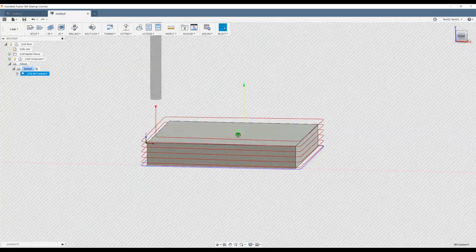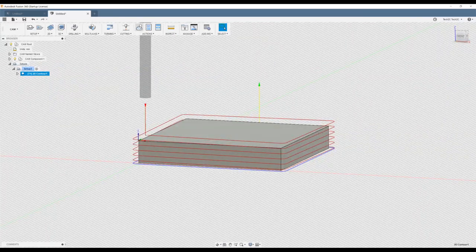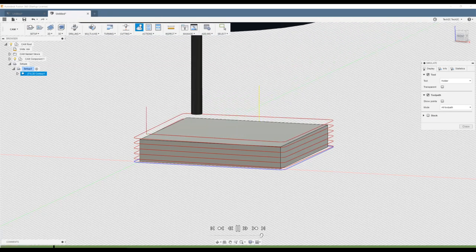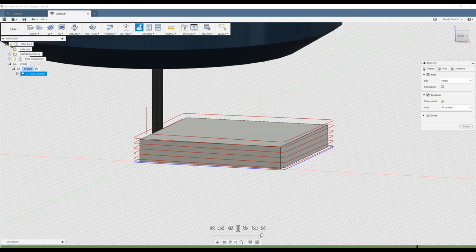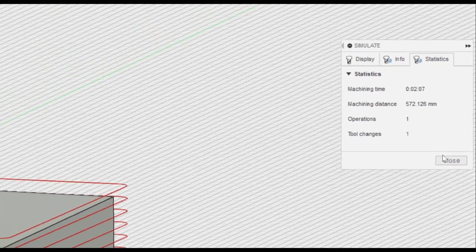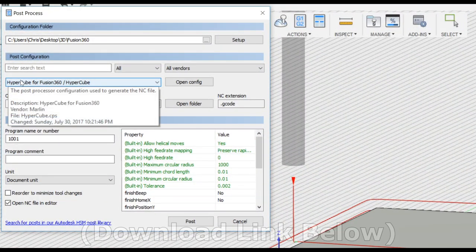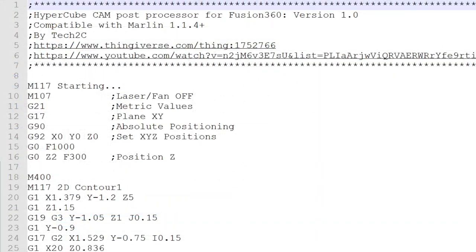And now we can see the travel moves that Fusion is going to create to be able to cut this 20 millimeter square. We can simulate this by pressing the simulate button and pressing play, speeding this up, and you can see with every rotation the end mill is going to plunge 0.75 millimeters down until it finally completes, with a total time of 2 minutes and 7 seconds. Lastly, hit the post-process button, choose the Fusion 360 post-processor for the HyperCube that I've created, links in the description below, and post.